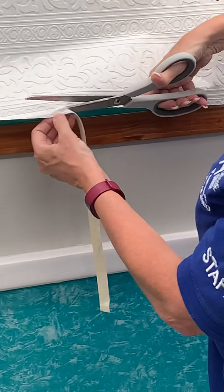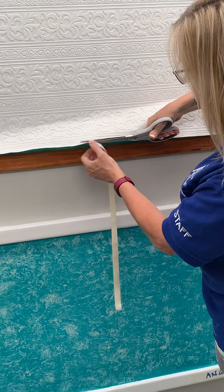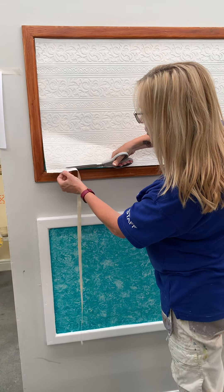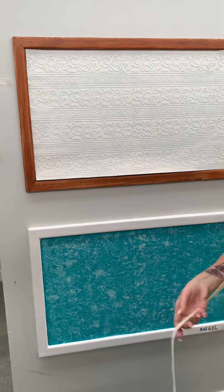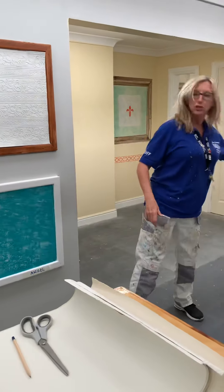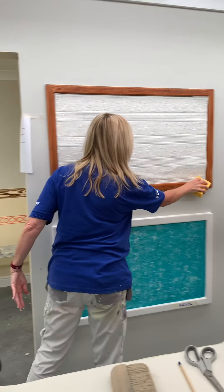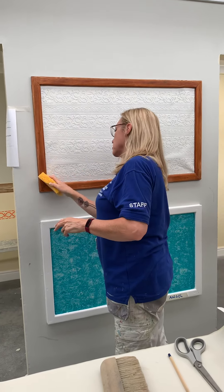Next week, you're going to put eggshell on top of these — two coats of an eggshell. If you've got a wooden frame like this one, you're going to mask it up before you paint it. If you've got a white frame, after you've applied the eggshell, you're going to give the white another coat of gloss. You can't do anything now until I've got the paste off the front — all the paste has gone onto the sides, none should have gone on the top because the paper just goes up to the top edge.